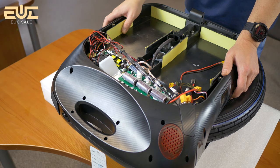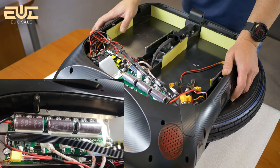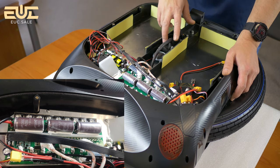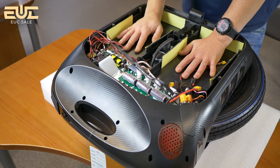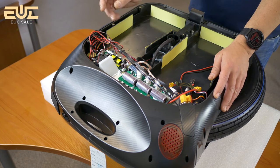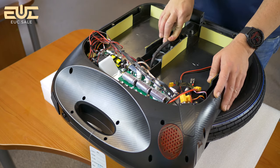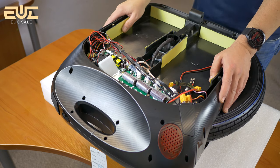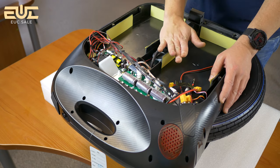So let's see. What we can see here: the new mainboard, the same DC block, the same cooler fan, a beeper here. We have tightened the pillars on 8 screws from both sides, and here are the compartments for the batteries — two here and two more from the other side. The structure of the controller is different, as we can see. There's a hole here — I think I will need to close this hole because all debris will go directly into it. So we definitely need to close that.